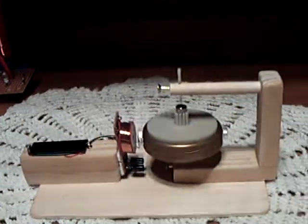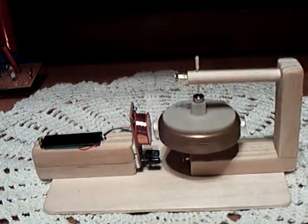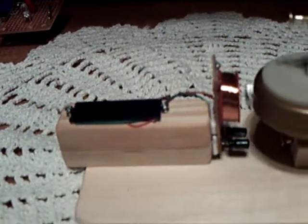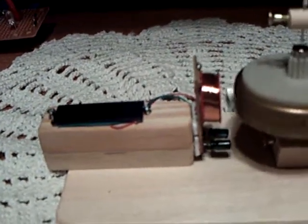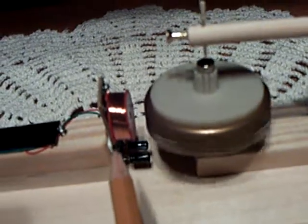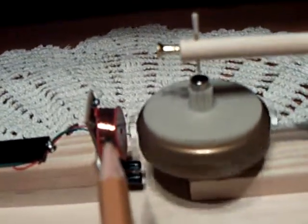That's my latest LED motor right there, but the other device I got out of a toy I bought off of eBay. It's an electronic pulse that drives a different type of device, and it's being driven by a tiny, almost calculator-size solar cell from the room lights. This is what I wanted to back-engineer — it's got two electrolytic capacitors, two transistors, and six resistors, a single winding on the coil, and it's driving that rotor off of room light.